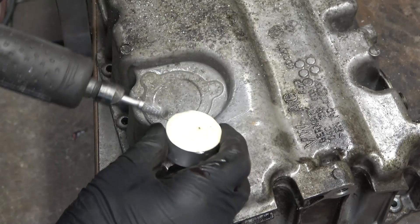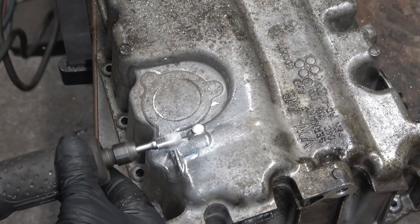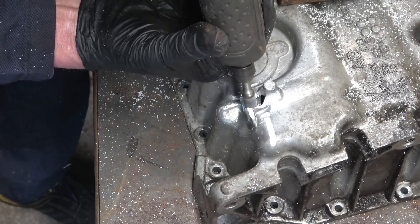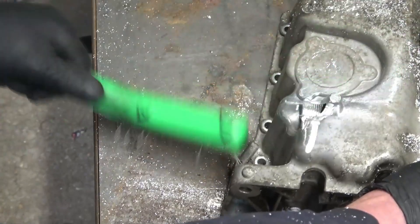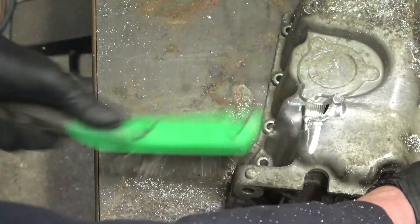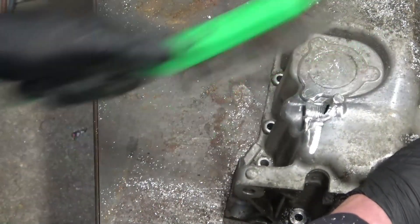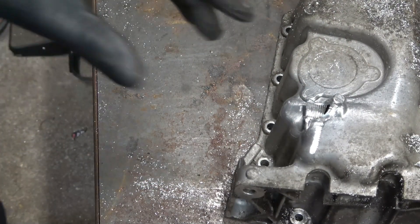It's all being washed out with acetone. When you're cutting aluminium, a little bit of candle wax on the cutter helps to stop it from blocking up. So we've done a suitable amount of damage to it. When you're wire brushing as well, you don't wire brush back and forth because that rubs the oxide into the aluminium — just do it in one direction like that. That looks reasonably clean. We'll give it a go and see if it'll take weld. It depends on what sort of alloy it is. Normally these are decent material.